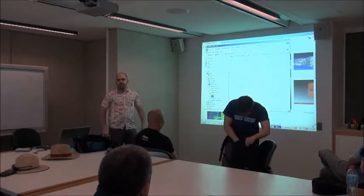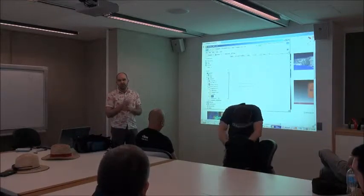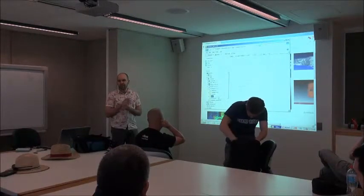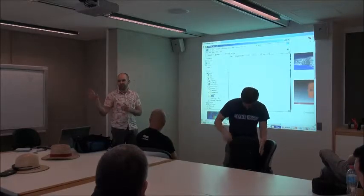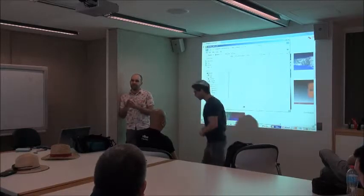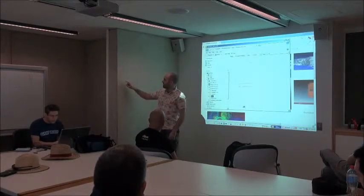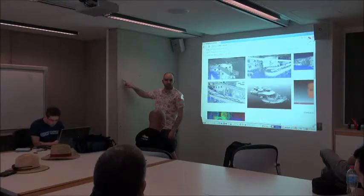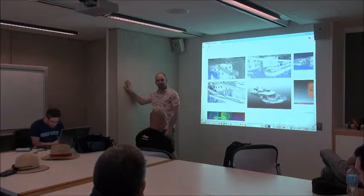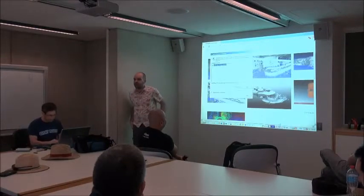But basically, color-wise the point cloud is difficult because the camera's not on the head, it's on the bottom. So we're getting within about 5 centimeters or so accuracy. So you're not going to see writing on a wall, you're going to see the general color of things. But also, you wouldn't use Zebedee directly for digitizing terrain for a game anyway, because its resolution could have 10 centimeters between points. It varies. So it's not really a dense point set, Zebedee itself. But it's just one tool amongst many that are available for digitizing the world.